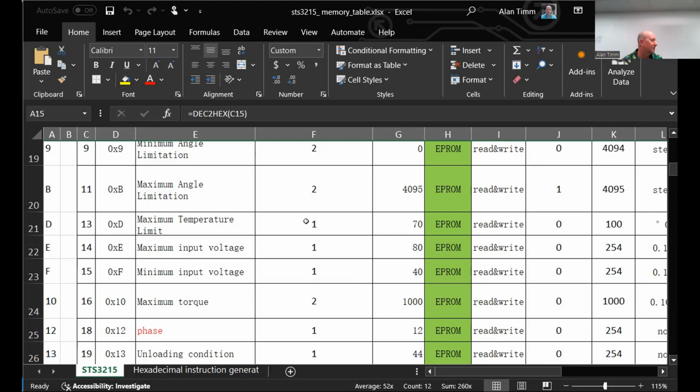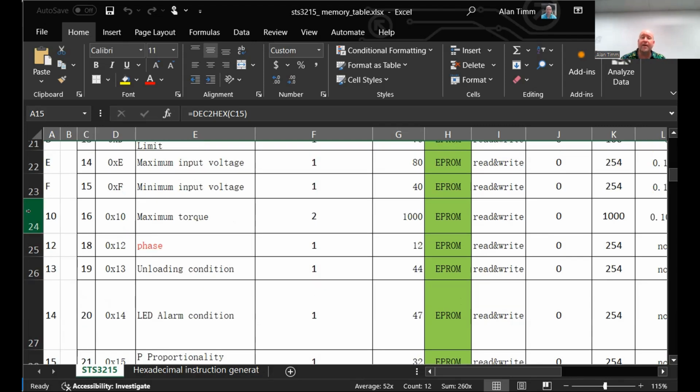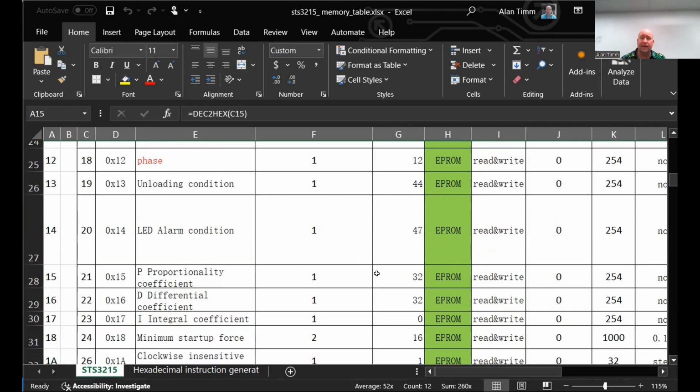I bought those on a whim a long time ago, but clutch servo, that's cool. Yeah, so these guys will not overheat. When they hit your temperature, they'll just shut down. Probably not super convenient if you're doing something important, but at least you won't have to replace it. You can define a maximum torque value to say that torque values over this amount, it won't honor. Just all kinds of stuff.